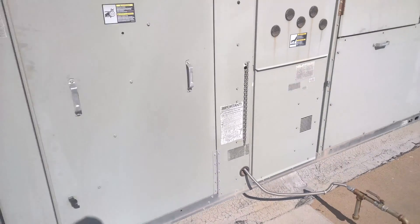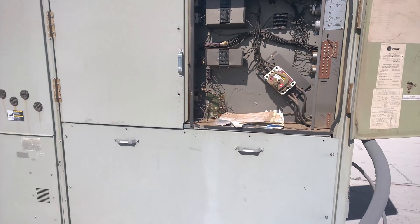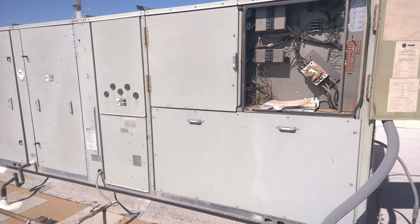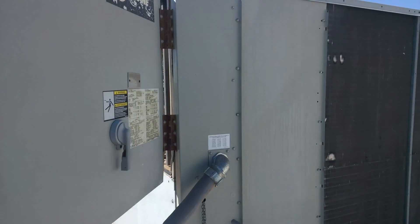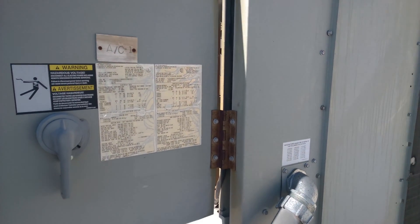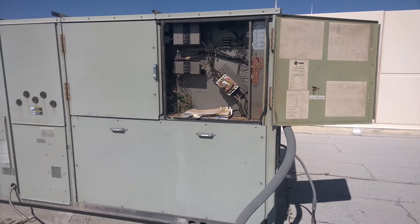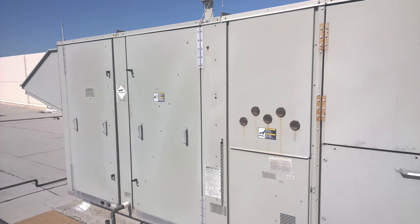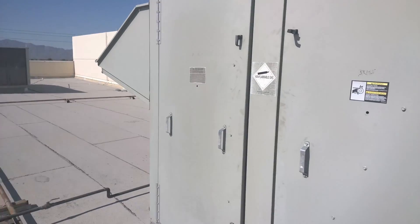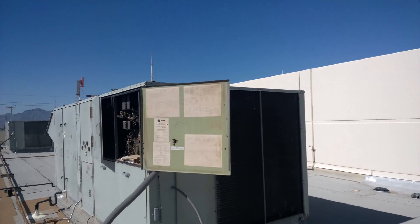Anyway, it's fixed. That was a weird one, but I did figure it out — didn't take me too long. Solid 1998 Trane unit. There goes second stage. This is the one I fixed a leak on the coil earlier in the summer. This is a YCD 420, so it's a pretty big sucker — 420,000 BTUs total. It's an older one, doesn't have a VFD — that could have been an option — but this one just has the variable vanes on the intake of the blower to regulate the air. It's not even any louder than a residential Goodman unit.